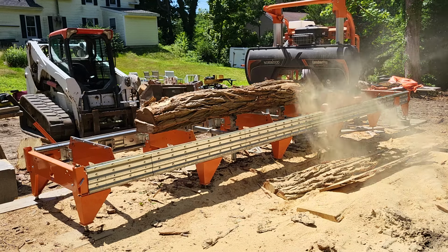Band is really getting whooped, boys and girls. I know that looks like a lot of cut, but it's not. The center of this slab cut's paper thin. All right, so I got a nice clean surface now. I should be able to drop on 2 inches from here. So I'm actually gonna set my 2 inch scale right where I am right now.